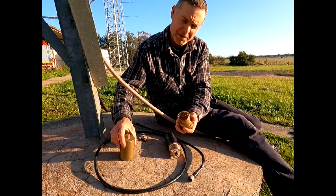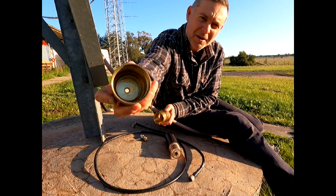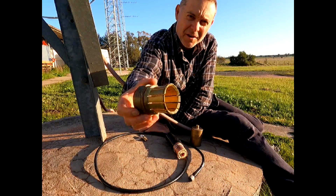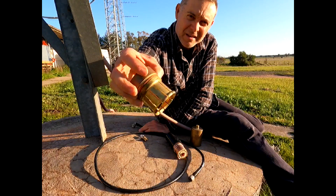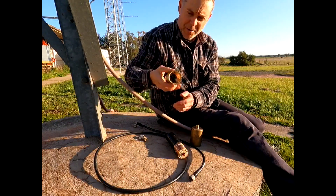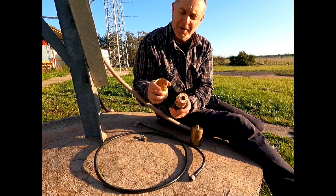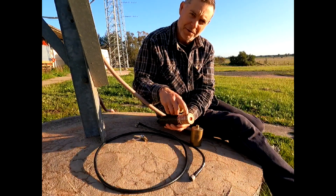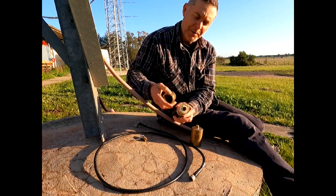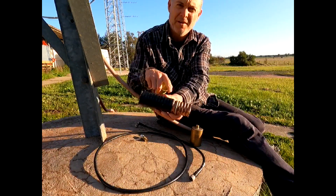The main body of the connector is in two pieces. Here's a view of the inside — that's the bottom part of the connector. You can see it's got those little fingers on it, a thread, and a rubber sealing ring down the bottom. When this goes onto the cable, those fingers actually seat in the top groove of the Heliax and stop it from moving. The rubber ring also seals at the bottom groove of the connector.